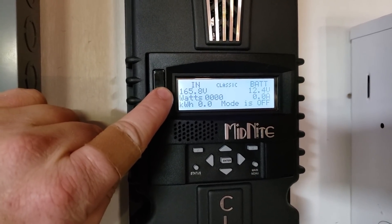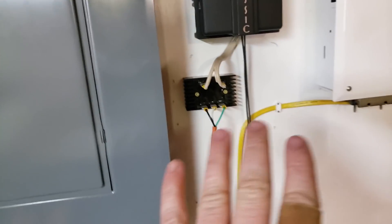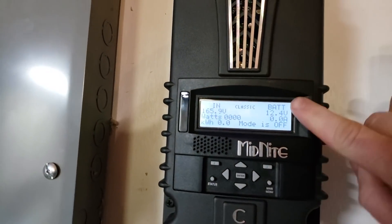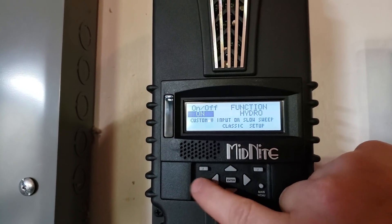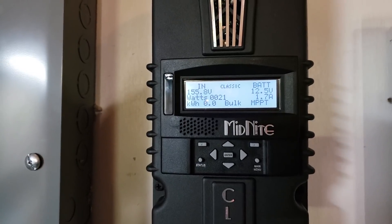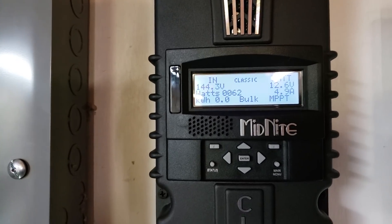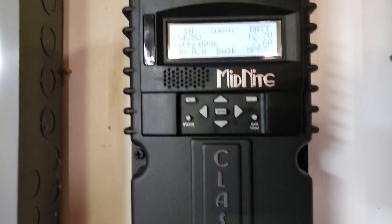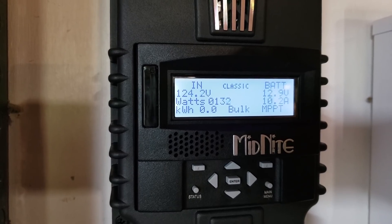So 165 volts open circuit — almost 166 — this is volts DC. Here's my rectifier: three phases coming in, DC coming out. All of this is still temporary and I know this is not safe because you can touch any of those and it wouldn't feel good. I have the output turned off right now, so let's turn that on. It's going to do an initial sweep, a full sweep down to battery voltage, and we'll see the watts increase up until a maximum — either a maximum watts available from the turbine, or I have the output limited at 20 amps because that's all my 12-gauge wire is rated for. It is in bulk charge so this should be full power to the batteries.